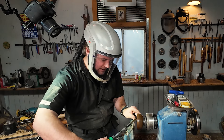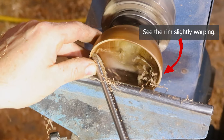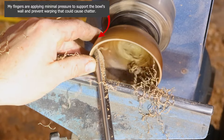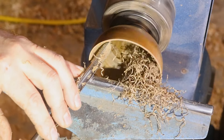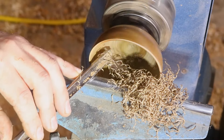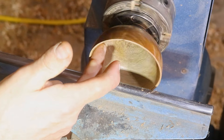I'm going to come in, find where it's cutting, open the flute, and slowly come down that wall. The tool is cutting at about the two o'clock position. I keep coming down, bring my hand around with fingers over the flute, and come around the bottom there, slowing the cut right down.